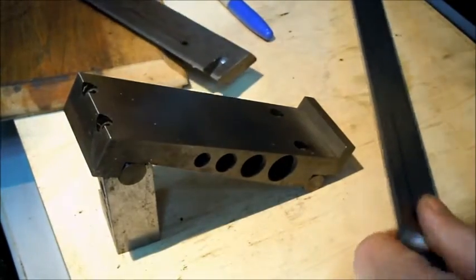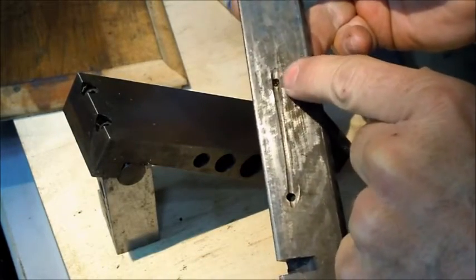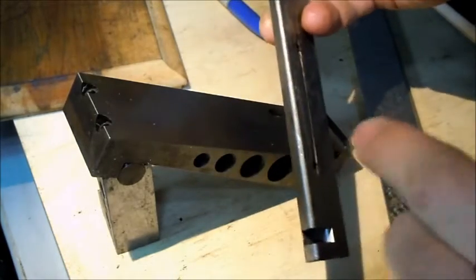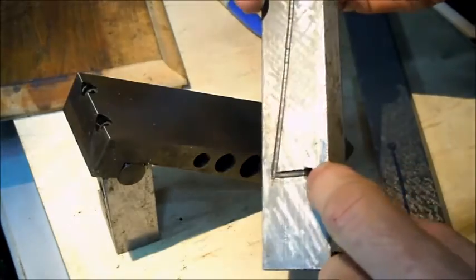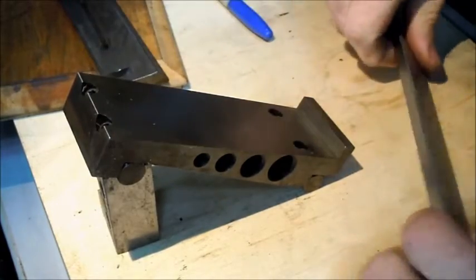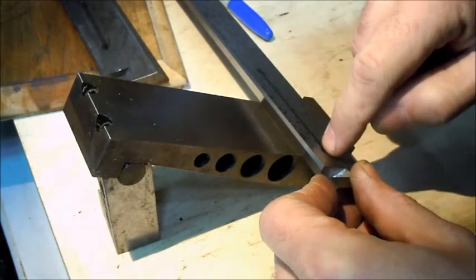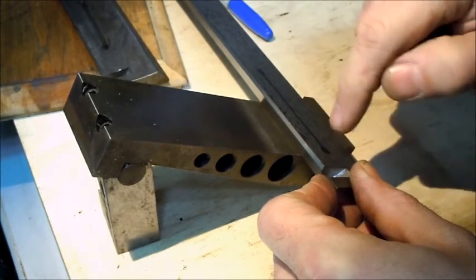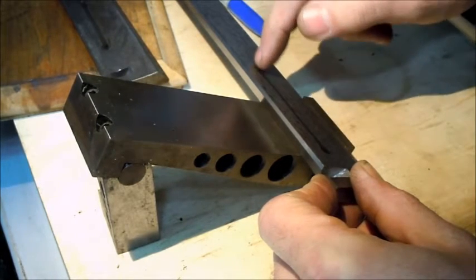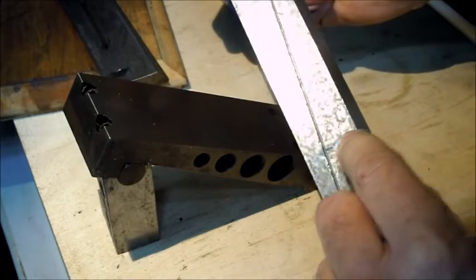Next is bringing through the oil hole — this is the old gib. This is about where the oil comes in from the knee, and it has to travel up through here, through the gib, and then start to oil the bearing side. I'm going to drill through — this will be a through hole here. The other hole will accept the oil coming through from the knee, and then we'll join these two with a groove, and same thing on the back side.